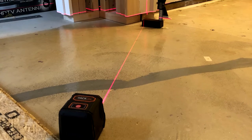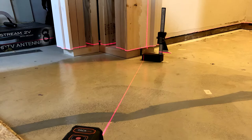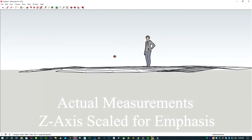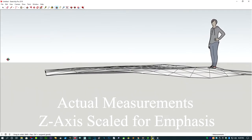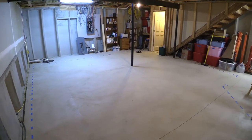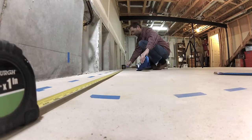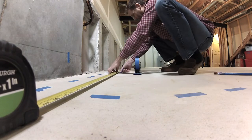I spent a lot of time measuring my concrete slab with a laser level and height gauge. This allowed me to understand where the high and low spots were and exactly how unlevel my concrete really was. Most videos suggest you use a self-leveling concrete mix to make the slab level. Unfortunately, my slab would require a lot of it, and it would exceed recommended thicknesses in some areas. My gut told me this just wasn't the solution for my floor.